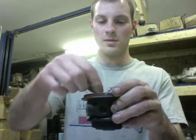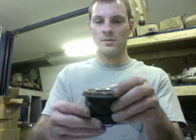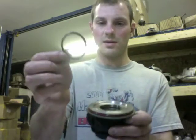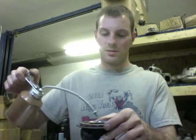Next you're going to take the thrust bearing with oil holes going down. After that, take your O-ring — sometimes you have to kind of stretch it out a little bit. Then oil your O-ring so the seal plate fits in there.